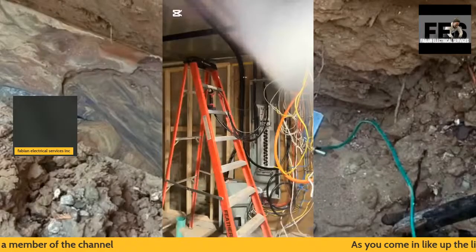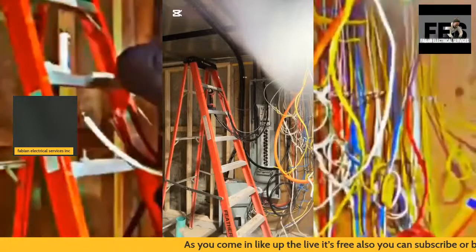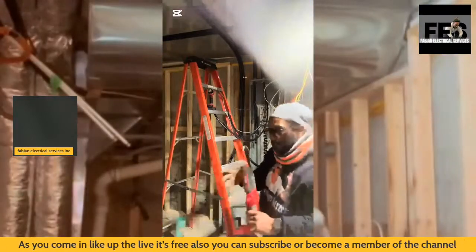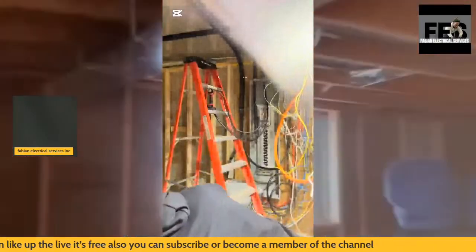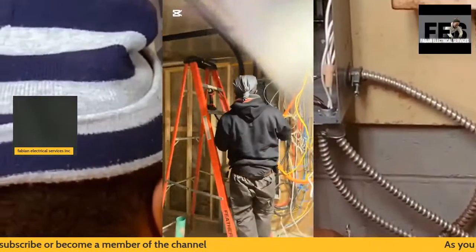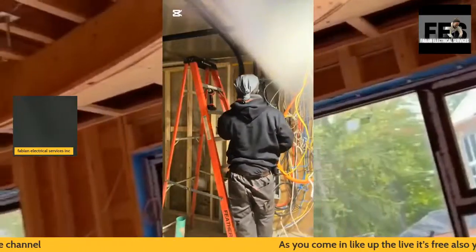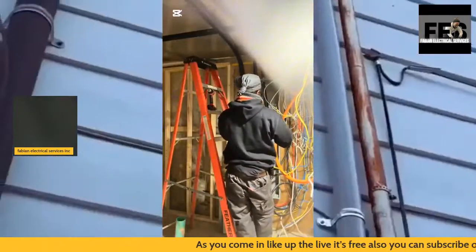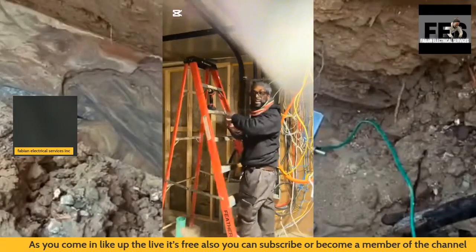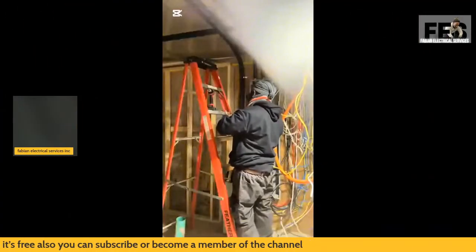The actual 400 amp panel. You can see my cables are landed, and I'm going to label the big cables right now. I'm going to phase the cable. It is a 400 amp installation using 250 kcmil wire for the service run, parallel runs.